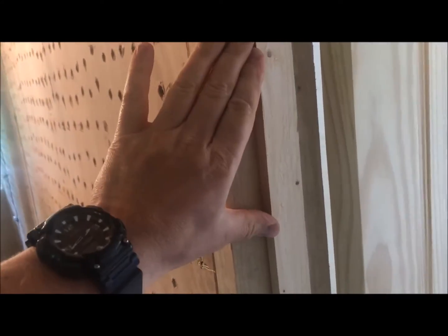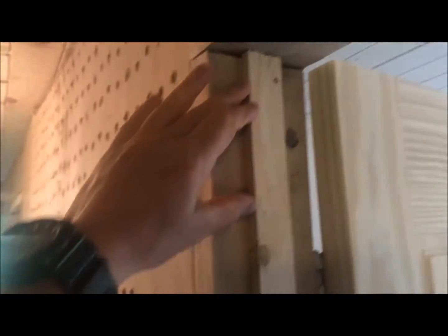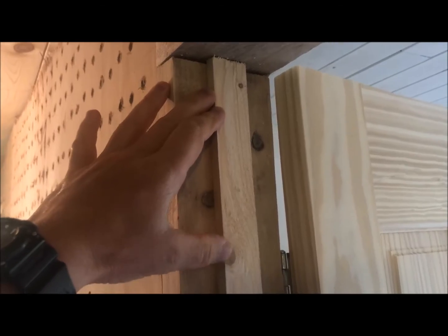And then bring it inside the door and just check, I've already hung this now, but just check that it fits in the hole properly. You should have a sort of 2-3 mil gap all the way around. And then what you do then, you make some jams. These bits of wood here are called door jams, which I think is spelt with a B after the M. These are just 1 centimetre strips I've cut off the edge of a scaffolding board.